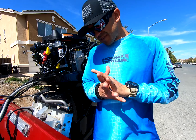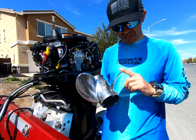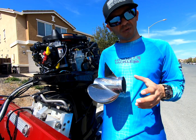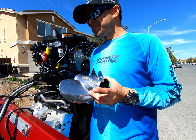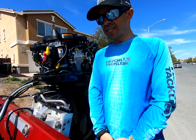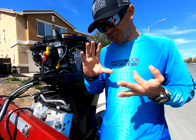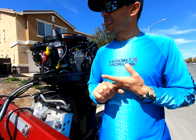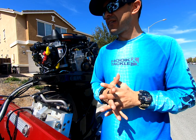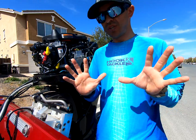And you are good to go. The size of the prop itself will vary — you may need a smaller or larger pitch. My best advice is to get onto the Mercury prop selector page; I will link it below. If you need help with that, drop me a comment and I can do it for you. I'll need your RPM, your current speed, and your current prop pitch. It's a relatively simple mod that can be done very quickly, but you need to have all three items at the same time.